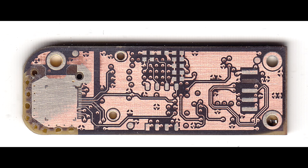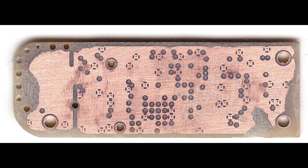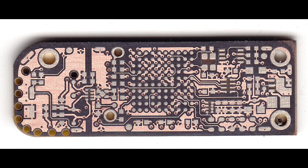I actually found that using a scanner gave about the best results. One of the issues was the texture on the surface from the sanding made it quite difficult to photograph using a macro lens on a normal camera, but the scanner made a fairly reasonable job of it. This is at 1200 dpi which is enough resolution to get enough detail. I haven't bothered trying to do a proper layer stack-up drawing because I'm not particularly interested in fully tracing this out — somebody on the EV blog forum thread has actually done it if you want to go and take a look at the images. The performance of this Seek thing is sufficiently disappointing that I don't think I'm particularly interested in doing any more work with it from the point of view of driving it with something other than a phone.